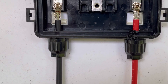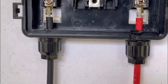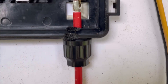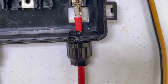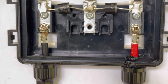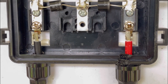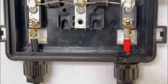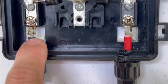All we did was slide the new wire up inside there after desoldering the old wire, then reconnect the old connectors. Don't do like I did and burn through your junction box with the bottom of the soldering iron — we'll just have to put some silicone there. Now you have to re-solder the wires. There may be enough solder left over to use the old stuff, but either way you need to make the connection — you can fold them over or solder it, so we're going to re-solder.